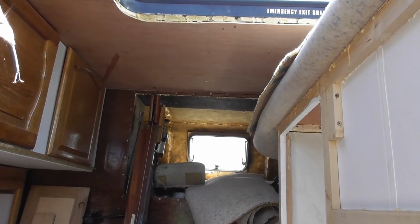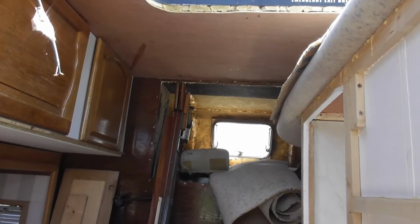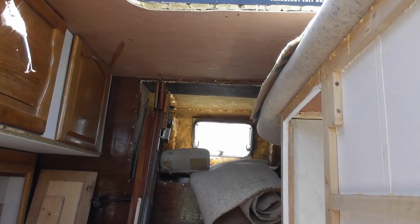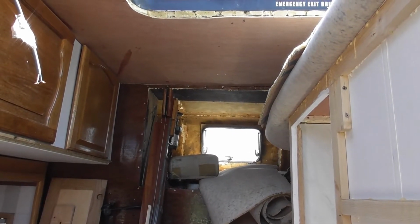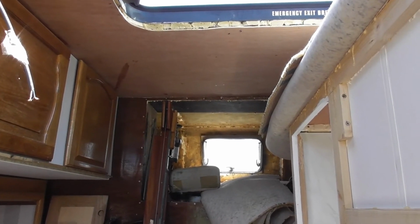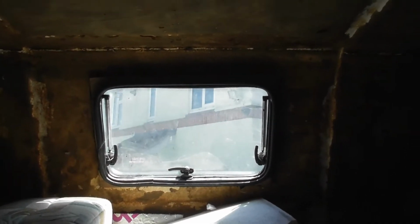And we'll put plywood over the top of that, and I'm going to try, if I can, the battens to hold the ply in place. I'm going to try and lock them in together. I can't really glue them anywhere because of the muck up on that ceiling line, but I'll try and lock the battens in all those grooves that you see, which will be very difficult. We'll push one up in that groove there, we'll go across there, we'll seal them in, we'll put props up everywhere to try and hold them. It'll take a few days for that stuff to dry.